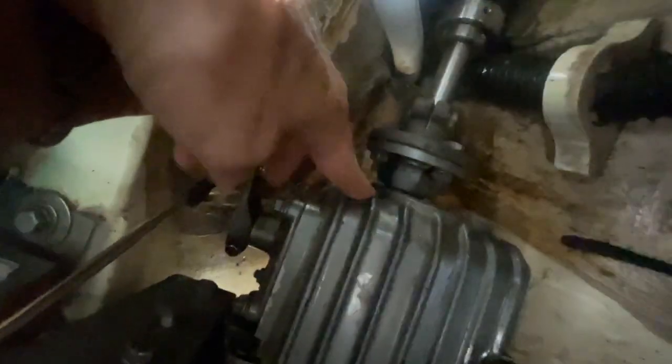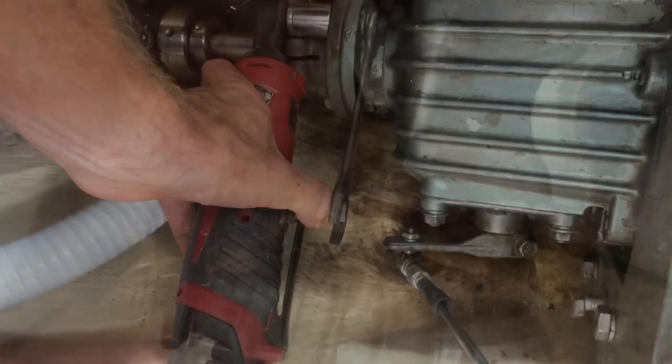So here is the coupler that attaches the engine gear to the shaft, to the prop, all right? Now I'm gonna undo these bolts here first, these guys. I've already undone these ones right here. It's no biggie, it just kind of clamps onto the shaft there. Once I get these off, my shaft will no longer be attached to the gear, and we'll pull it back a little bit, and there'll be a trick to that as well, but I'm gonna go ahead and do that real fast.